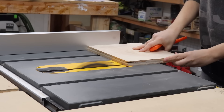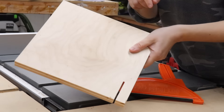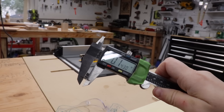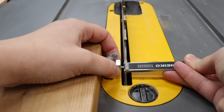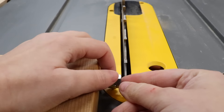The first step to making this jig is figuring out how wide your blade kerf is. So I did a stop cut on the table saw, and then I took out my calipers to measure that kerf. I'm going to be making a pin that's the same width as that kerf. And since that kerf is so thin, I'm going to use my thin ripping jig. I lined up the calipers with the bolt on the jig to get the perfect measurement, and then locked it down.